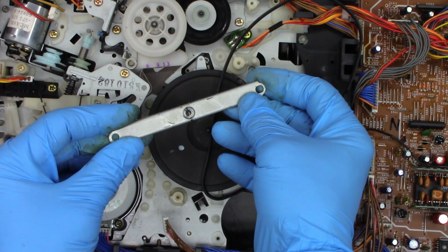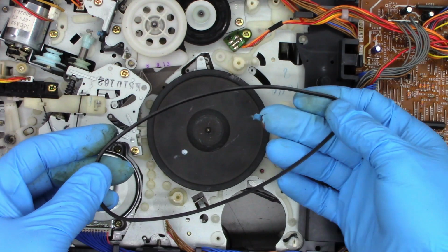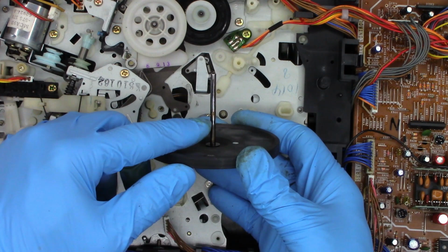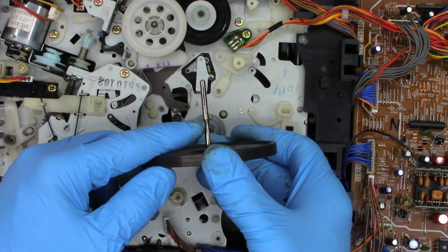Go ahead and clean that, and I think I've got some white lithium grease. We'll put a dot of that on there. Take that nasty belt, it's pre-stretched. Now this should lift out very gently. Oh, perfect. Now we can actually clean this thing up. It's got a bit of scoring on the top bushing right there. I can catch my fingernail in it. If this were an I Do Cars episode, I would not reuse this camshaft with that scoring on it, definitely.